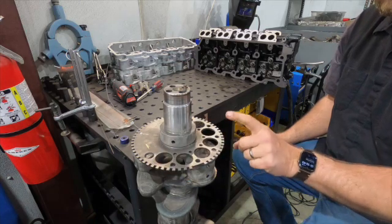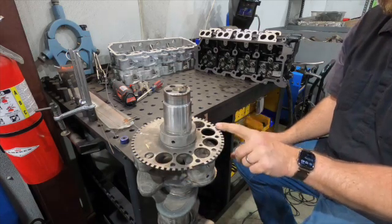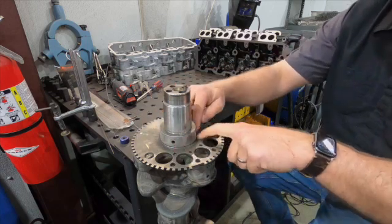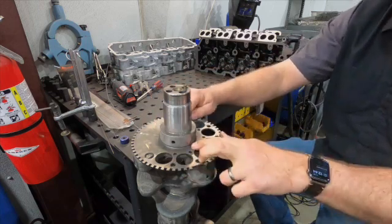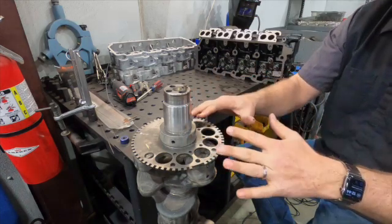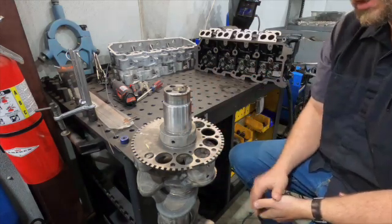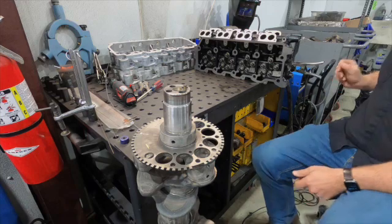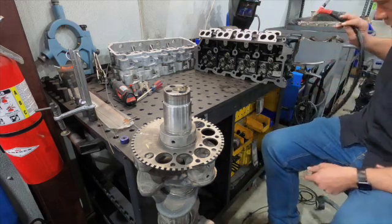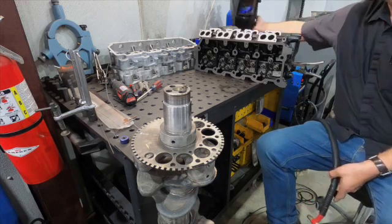We do, but especially if the wheel has been removed, the Reluctor ring or the tone ring, it just presses on here. It just has a register onto the snout of the crankshaft right here. And so just after having been removed and pressed back on, we like to just put a little TIG tack on there. And today we're using a Miller Diversion 180.